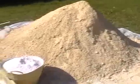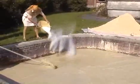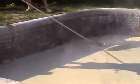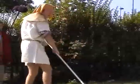The two components will react in the water and build in situ geological glue, which will then yield the hard geopolymeric rock, agglomerated limestone. We start making the cement by mixing sodium carbonate, found in Egyptian natron, and lime in 500 liters of water. We then add the kaolin, inherent to Giza limestone, and stir the mix with a wooden tool.